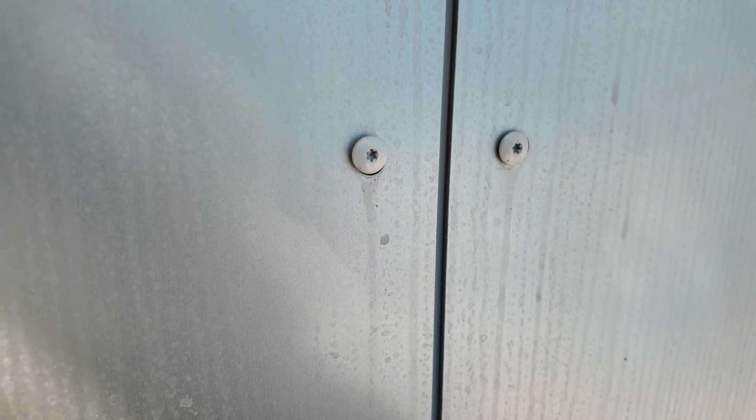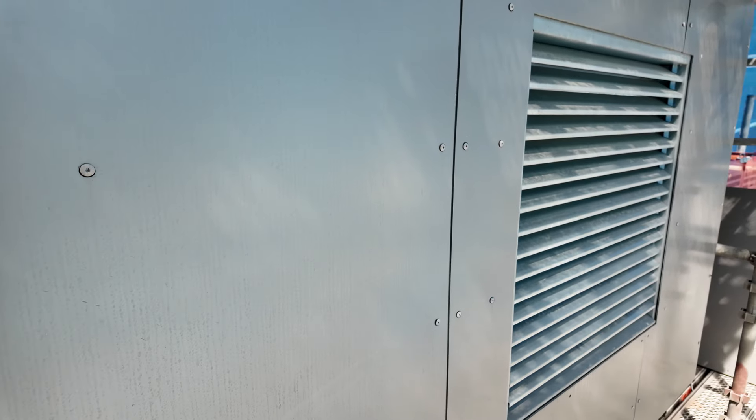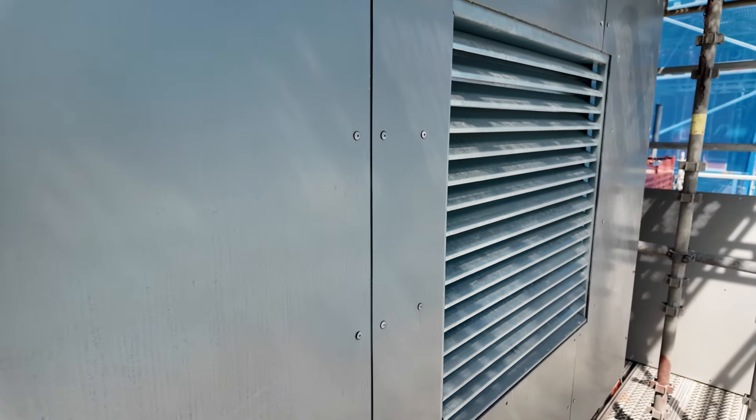There's actually a gray piece of paper about three inches wide that's run on the furring strip. When we look at it dead on, it provides that gray look on the inside. One of the things I don't necessarily like about these panels is this facing here doesn't turn the corner and go inside — it basically just stops and leaves somewhat of a raw panel there, which I think is susceptible to a different kind of weathering.